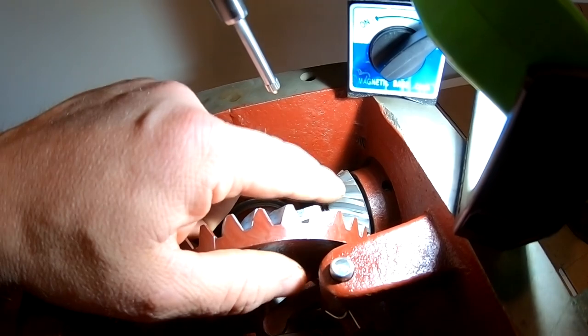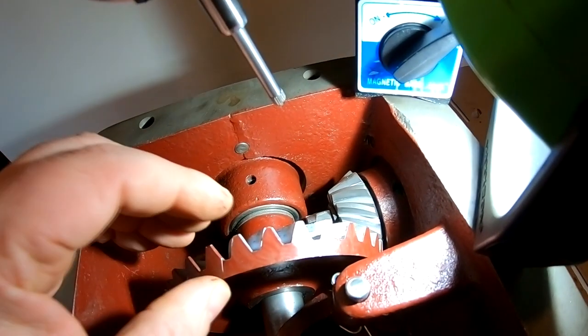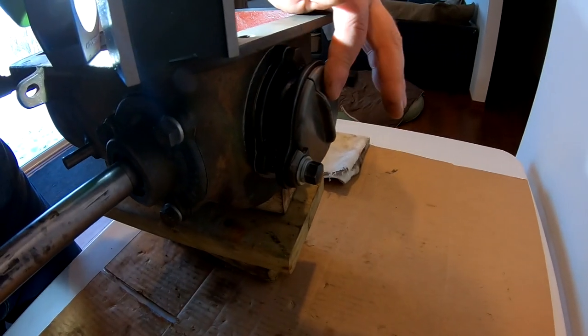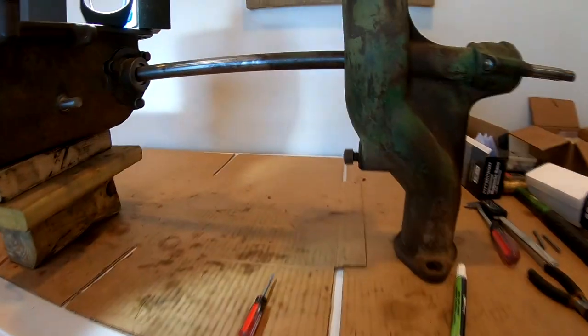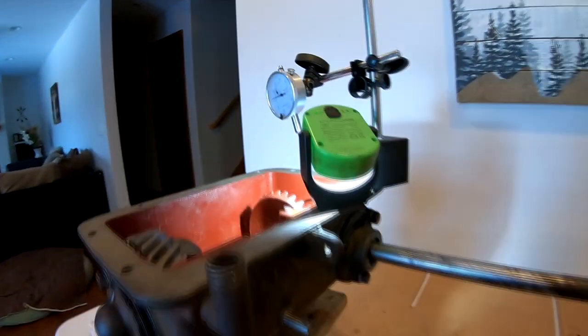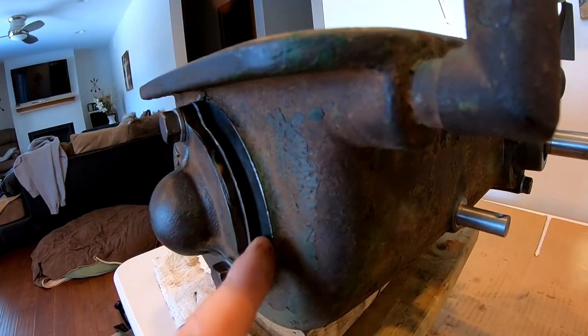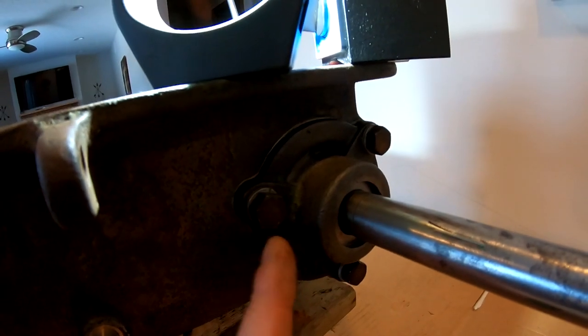From there we look at contact pattern and backlash. Getting the shim pack set up: on the magneto side I have three thick and two thin shims, plus a homemade thick shim — I went to Walmart and picked up some poster board tag board, which is about the same thickness as a thick shim, and made one extra. On the flywheel side I have one thin shim behind the carrier, and the fan shaft has one thick shim.